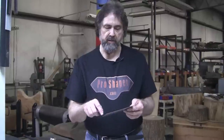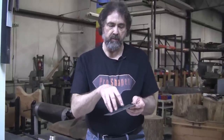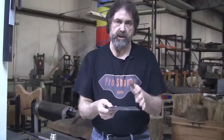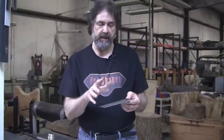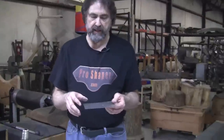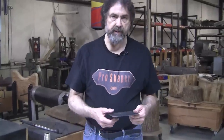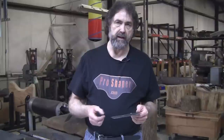If we shrink along the edge, we'll reduce the surface area, and what will happen is there'll be less square inches on this panel, but you'll create a dome shape in the middle. And that's one of the techniques to make dome shapes, or to make shapes, is to shrink around the edge. You can also stretch the middle. So the first big step in learning how to do this craft is learning how to properly shrink and stretch.